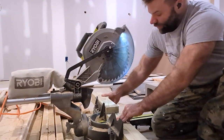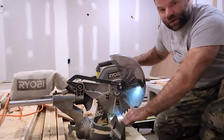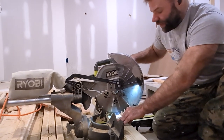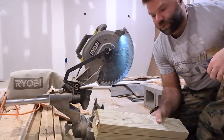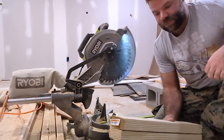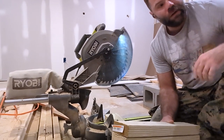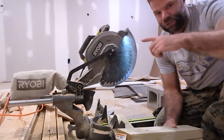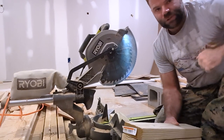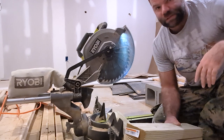I'm going to go 18 inches from the wall to make the cabinet. That will hold everything, and then I'll keep the Star Wars column angled section as short as possible — mostly for the look, but also for cord pass-through. Use pressure-treated lumber whenever you're going against a basement or cement floor. That way if water or moisture backs up, it's mold resistant and rot resistant. It's well worth the extra money for the bottom part of the room. For parts going up the walls against the ceiling, use regular lumber — it's going to be inside walls. You can even try to get rough cuts from a lumber mill; a lot of times that's cheaper.